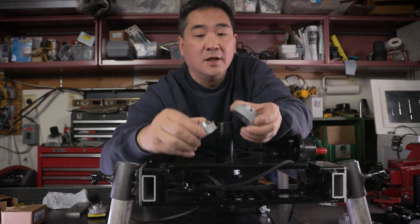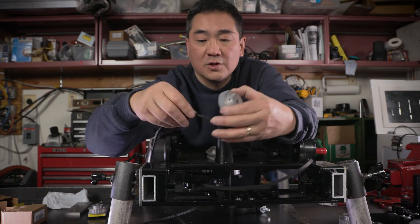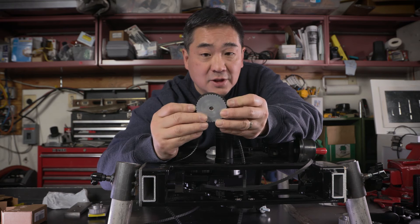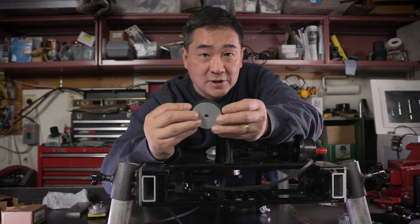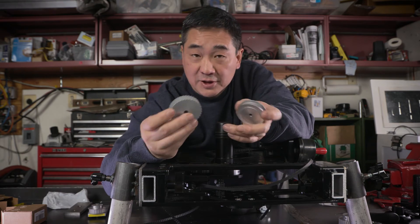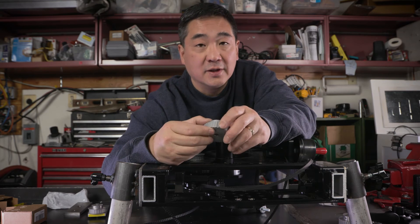To secure the timing belt instead of coming up with a custom CAD solution, I bought a couple of these timing belt gears — they're keyed to the shaft. The way they work is the belt fits onto them, and as long as you have some tension the belt won't slip on the gear. With a V-belt or rib belt there's always a tendency to slip, but with a timing belt it won't. I bought both the flanged and unflanged versions since I didn't know which would be easier to work with.